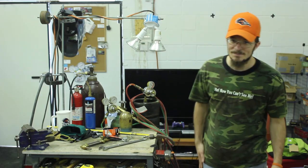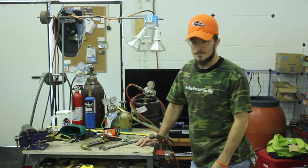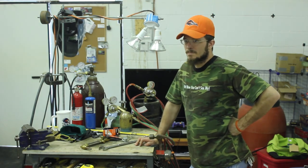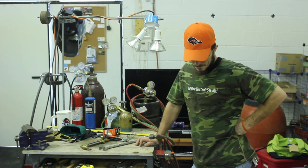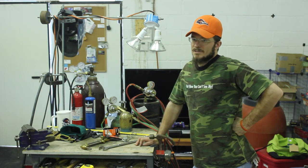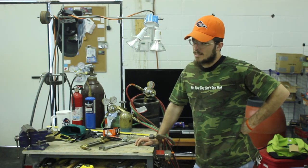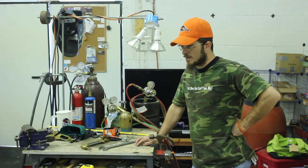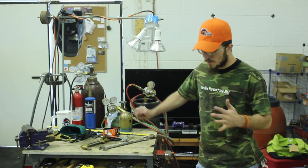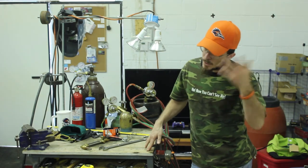You know, when you go buy fresh, cold steel, you're not going to run into zinc. But you start grabbing hardware out of your junk box and welding some bolts together to make a hinge or something, it's very likely that stuff is zinc-coated. So you have to think, pipe may be zinc coated. Right. And you can weld it. You just need to do it with a fan outside, yada yada. I weld outside with a fan if I'm welding zinc. And I have. I've welded some fence stuff and some gate stuff. And I have this big old blower that I got out of a scrapped house furnace.